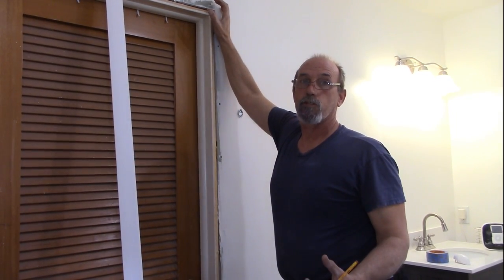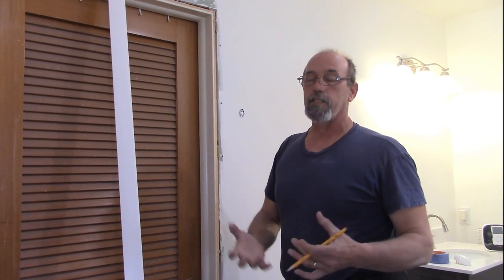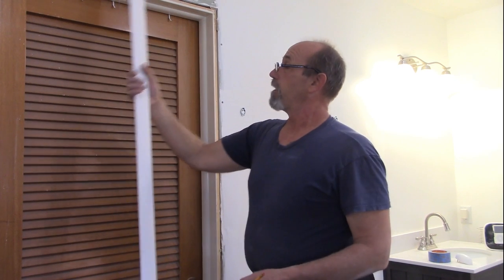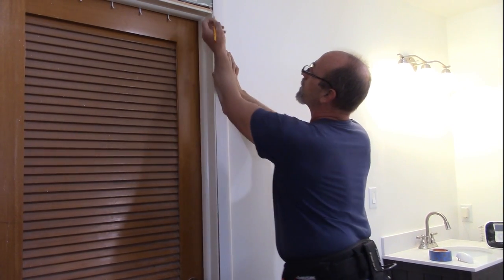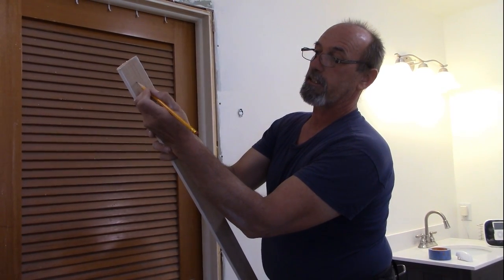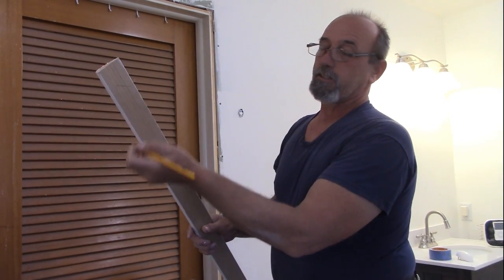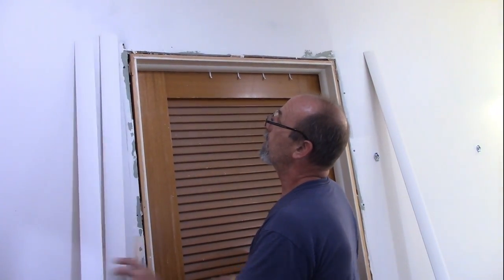This is being more precise since we're doing the finished work — we want to keep everything as tight as possible. Just throwing the tape measure up there and saying 'oh yeah, it's here,' you can be off by a sixteenth, and in the end you'd have to do some latex caulking to get that to look pretty tight. So the next thing I'm going to do is just take the piece of trim, set it where I want it to be, and put a little mark on the trim. I'm going to turn that trim back around and put a line in the direction I want it cut, so when I go to the saw I cut the right direction — don't want to cut the wrong direction. Then I'm going to do the same thing over on the other side, coming in to get my quarter inch.